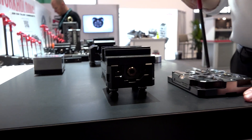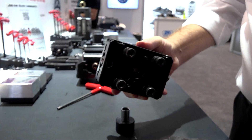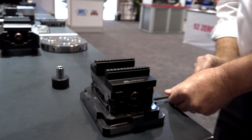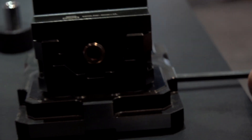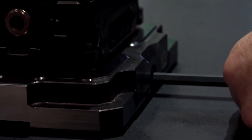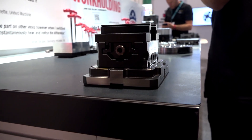In the base itself, there's a point where you find your zero, or point of origin, with the probe. I take my vice, which has the pull studs on it, and mount it onto the base — then just screw in one single screw. There are four zero-point plugs, but all you need is that one screw. The system inside the base is a yoke system that pulls all the pull studs to the center of the base with equal force, with all force vectors directed to center. This gives greater surface contact on the pull studs than other modular systems. The repeatability between base and vice is approximately two-tenths, or about five microns.